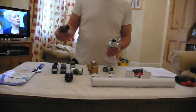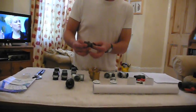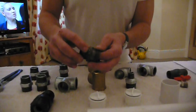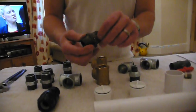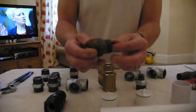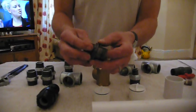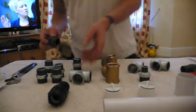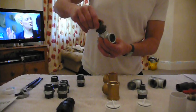We'll put on here the snifter. This is one of your one-inch equal nipples — basically you drill a very small hole in here, about one or two millimetres, and you put a little split pin in there. This is going to be your snifter — I'll talk about that in due course. That allows a little air into the pump. So we put that onto our equal T like that, just screwing hand tight.